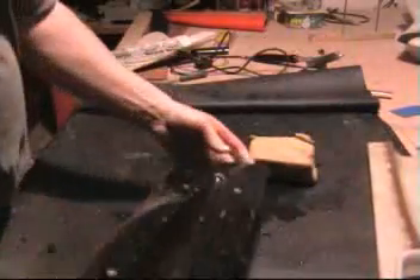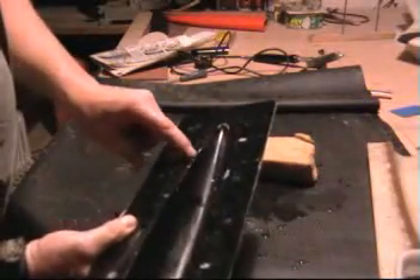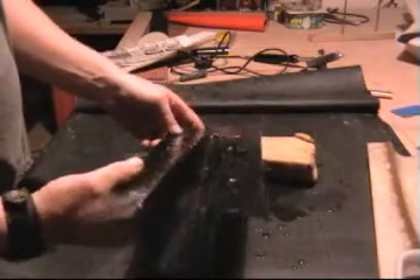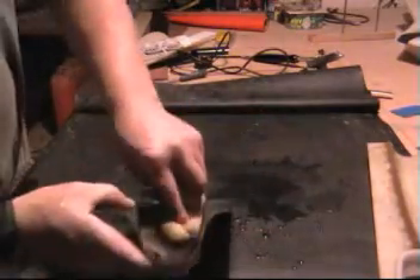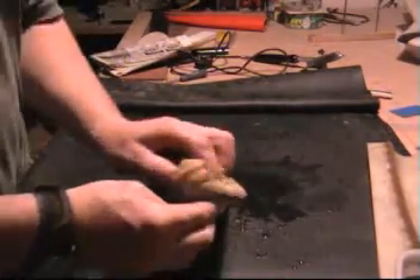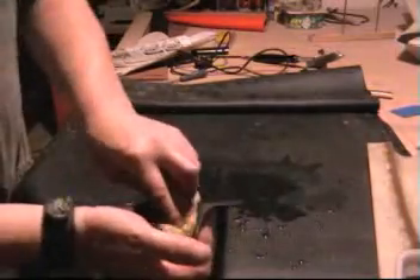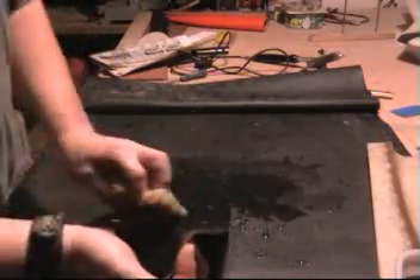But this half — you can see — got a little bit of damage along here and a little bit around the nose. Bit of a pain. Probably fill it up with car body filler. It's a pretty much disposable mould anyway, this one — just a quickie made out of polyester chop strand mat, makes it cheap. If you want a good one you want to use for a long time and get many parts out of it, then go for epoxy and glass cloth.